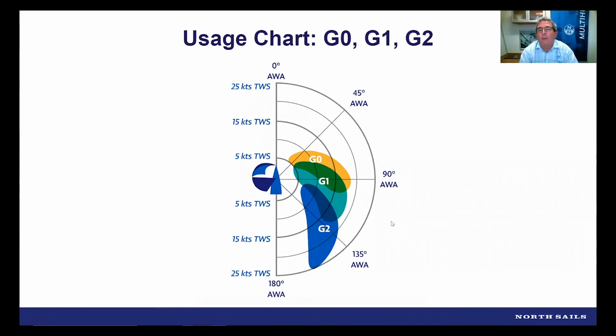Done some. They've got a tighter range. They can be dead downwind, and a little higher. The people that I've worked with that usually are interested in that tool to sail almost exclusively deeper angles are usually crossing the Pacific or riding trade winds in a certain direction. I don't think I have a graphic, but it lets you use both bows to fly the sail with the tack on the windward bow, and then sheet it off to leeward like it would be with an asymmetrical.